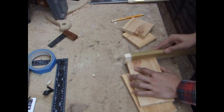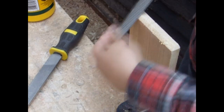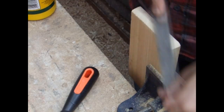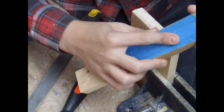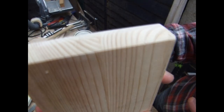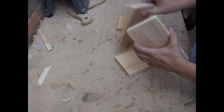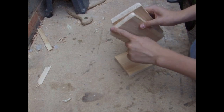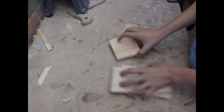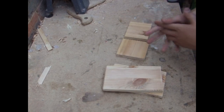With nice smooth passes, those cuts clean up quite nicely. I then add a decorative chamfer along one of the top edges of the two larger pieces, using a combination of a rasp, file, and sandpaper. Long smooth passes will give you the most even edge. I've now got the four pieces I need, with chamfers finished along the top of the two larger pieces, and most edges sanded to save time later — it's easier to sand while they're all apart.